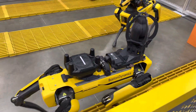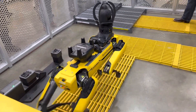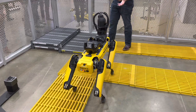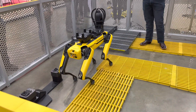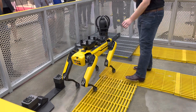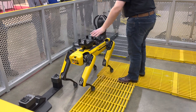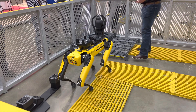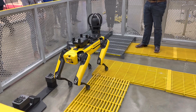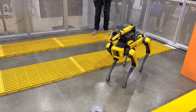Great question. So the question was: how much payload or how much weight can the robot carry? It's 30 pounds. You can actually draw power from the robot system to the payloads as well. You can configure it and even customize it. You'll see here there are two metal rails, and there are sliding nuts that you can actually move payloads back and forth. You basically create a bounding box and tell the robot what size of payload is on its back, and it will do a mass estimation to adjust its traction and locomotion accordingly.